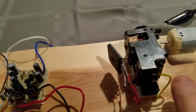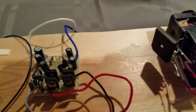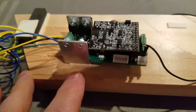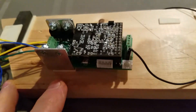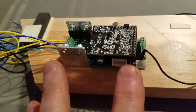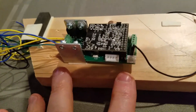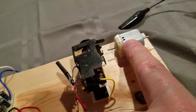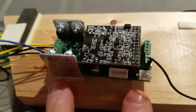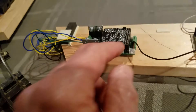For twenty dollars a Lionel DC controller does forward and reverse and mimics forward-neutral-reverse-neutral-forward. This is a version of the Electric Railroad Commander — probably a DC commander. This is one of the older units, good for four amps — it could run a pair of Alco can motors. So if you had a four-axle Alco with can motors, you would use something like this. It takes a wireless controller input and takes track voltage.